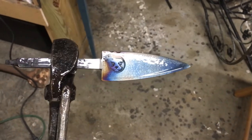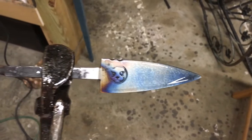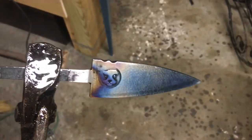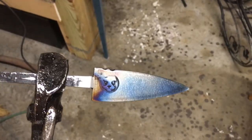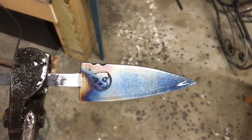Panda Bear Forge - that's what it looks like after a torch temper. I let the blue kind of travel down a bit and then I quench it in oil, so it doesn't steam or smoke up or anything like that. After you do that, I'll hit it with a sanding block and then it'll go back to its steel color.